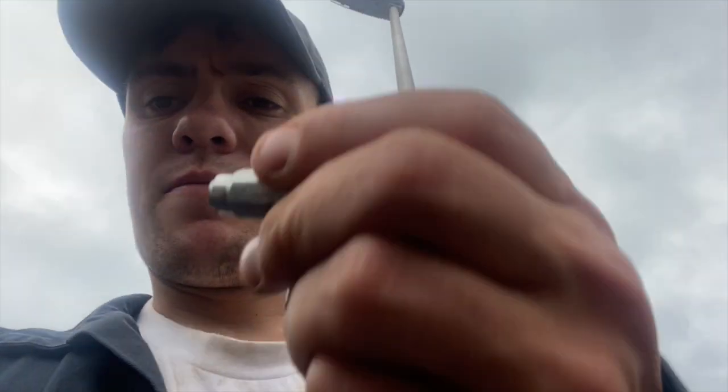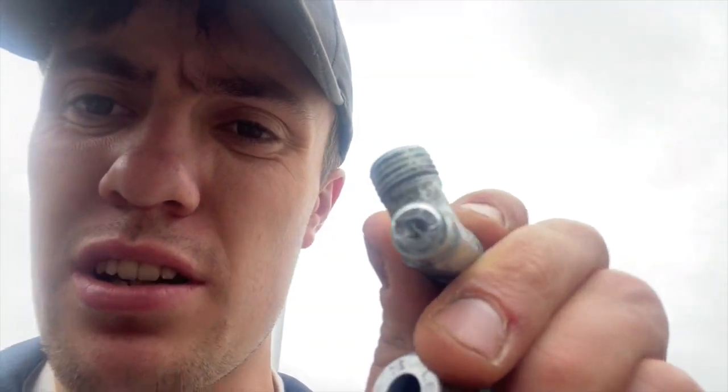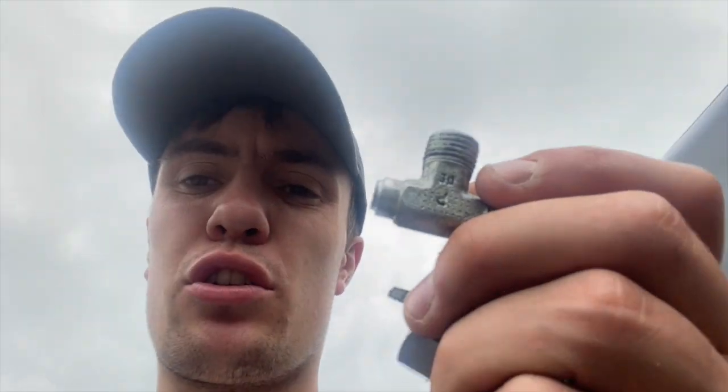So our baler's a Claas baler as well. And we had a broken part on it. This wee bit here, you can see this end is sheared. So it's to do with the disengagement of the drive when the back door opens. So he's got me one, it's not the same one, it's different. He didn't have the right one in stock, but he says that'll work, so hopefully it'll work.